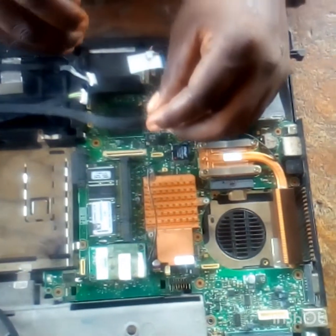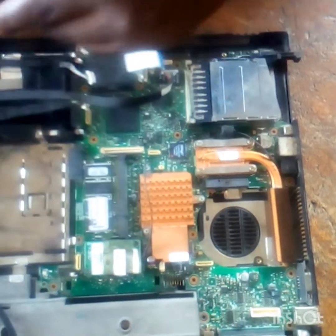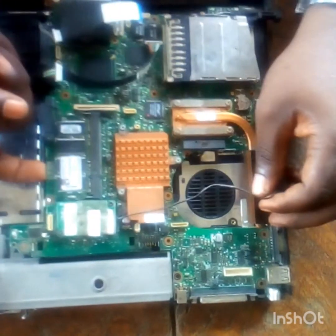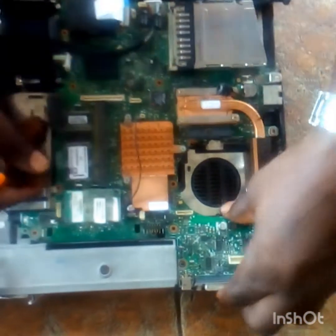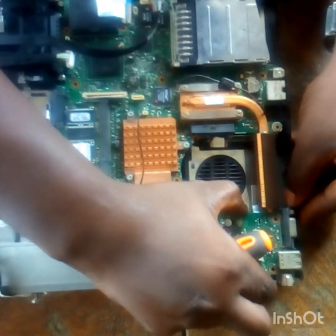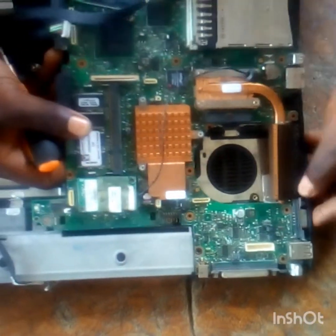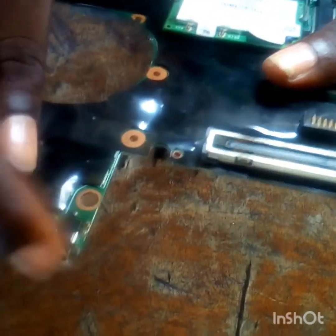You have to be careful and protect the laptop so no other component gets damaged. Always, before you start opening a laptop, take off the battery, because you have to know there is still voltage remaining inside. Always remember there is 3.3V always present in the power rail of the laptop. Maybe in our next video I'm going to teach you the different voltages inside a laptop — when the main power rail comes in, it spreads and converts to different voltages.